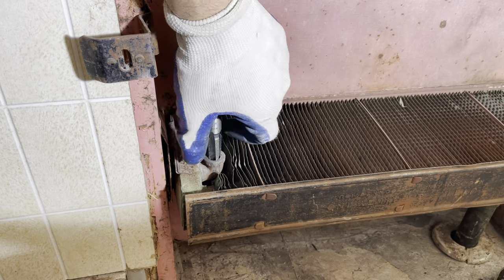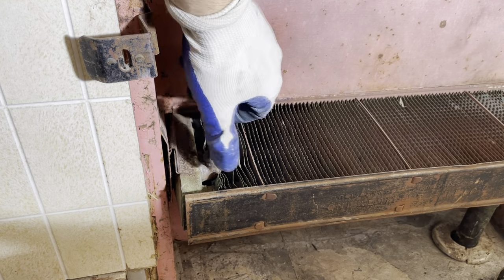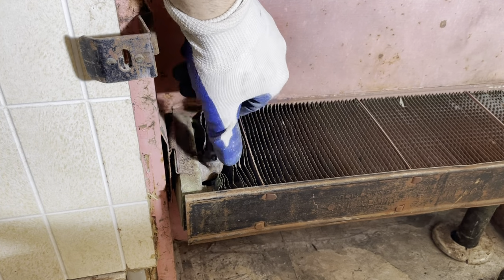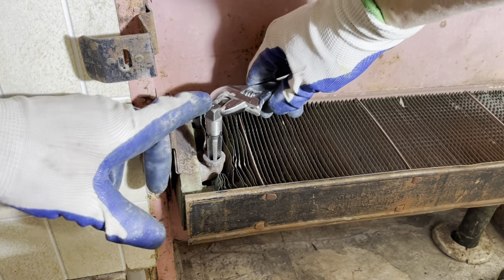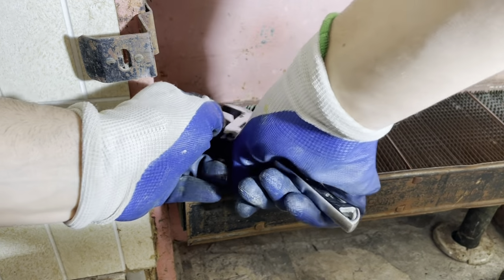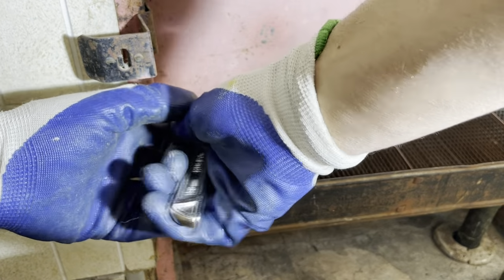And since we don't have any lubricant to use here, and we really don't want to use any lubricant, we're doing some good back and forths. We're not using any power tools. And I'm just letting the tap really do the work, making sure the tap doesn't break off or anything horrible like that. If the tap breaks off, then it'll be even harder. Just gonna have to get the tap out before we do another tap.